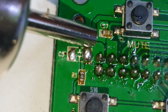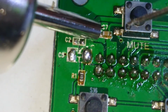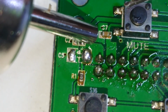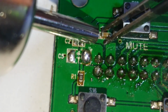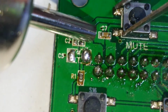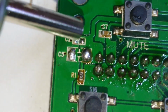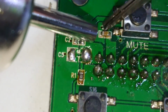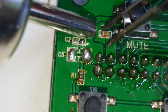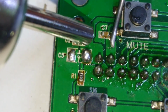I think if I've got proper components, or if I'm soldering these on, I can probably use low melt solder. Could be that this is either out of China and this is lead based solder, or it's not low melt. Something like that. This requires a lot more heat to get things off. That board is getting overall quite hot. I'm trying here without flux or a bit of extra solder. Yeah, and apparently the melting point is a little higher here.